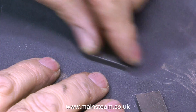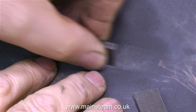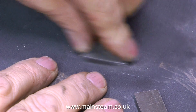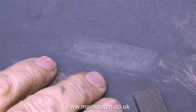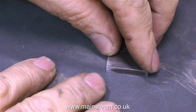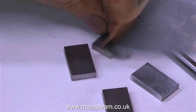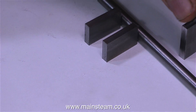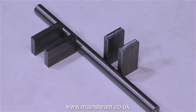After cleaning off the burrs left by the milling cutter on my one-inch belt sander, I then finally cleaned up the pieces of metal on some wet-and-dry sandpaper that is 400 grit. I'm going up and down, although many people have told me I should go round and round, or in a figure of eight, or even in a letter S or letter P formation. Ever since I had the electric shock therapy, I do seem to clean up pieces of metal like I show in the video.